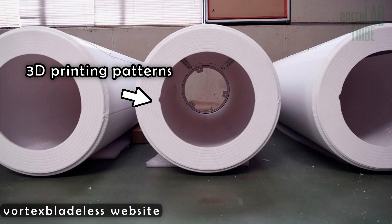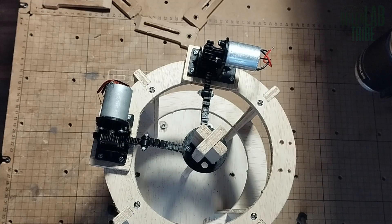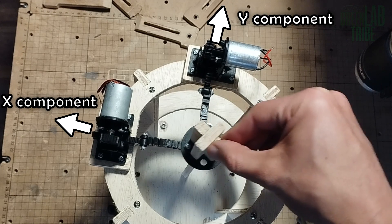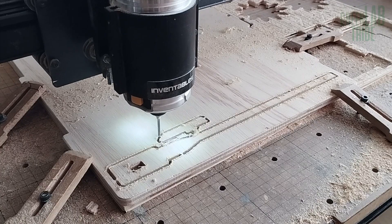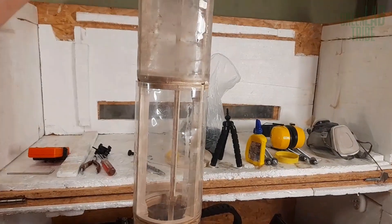Now back to the subject. I designed a prototype to actually see how this kind of turbine works, with the help of a CNC machine, 3D printer, and of course my computer. I tried to keep it simple — I divided the vibration motion into X and Y components and put small generators on each side. I did this because I already had a gearbox design that could do the work instead of designing a whole new type of vibrational generator like the one that Vortex Bladeless has. I used common dynamos because they are easy to find and can provide voltage even at low speeds. The structures were made with plywood and the pole was made with plastic bottles by cutting the top and bottom and putting them together with the structure. For the dimensions I tried to maintain the proportions of the original Vortex Bladeless Turbine, scaled down to make it smaller. Once the parts were cut and printed I put everything together.